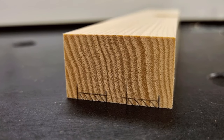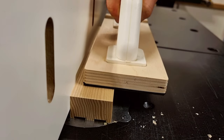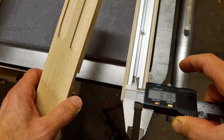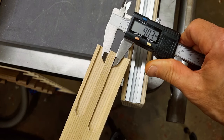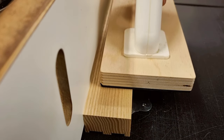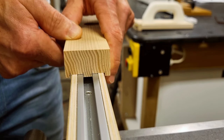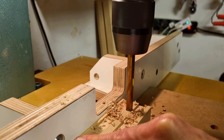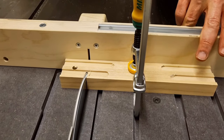For the top part of the stop I use a scrap piece and route two grooves. The inner groove is on the safe side, leaving me some margin. I then measure the inner dimension of the T-track as well as my remaining part, adjust my fence accordingly, and make a second pass for the inner groove. This gives me a perfect fit onto the inner portion of the T-track. I drill a hole for the locking knob and then cut the stop part to final dimensions.